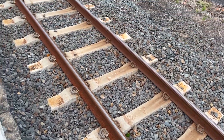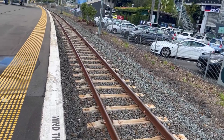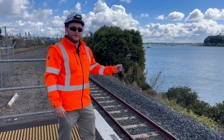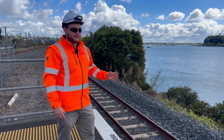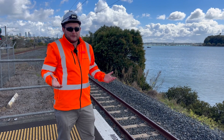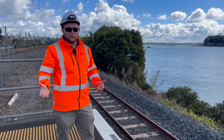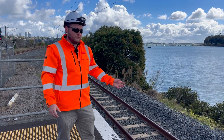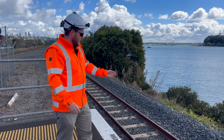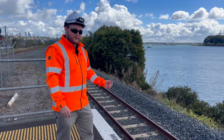and this takes around three to six months to wear in. You can see here on the rail that there's the rusty bit and then there's the bright mark. That bright mark is the contact pattern where the rail and wheel interact. The point of grinding is to allow us to move that contact band to a more central position. When rail arrives, it arrives fairly square and generic because the rail comes from a supplier that gives rail to different countries around the world that have different trains and different wheel profiles. So, once we install the rail,